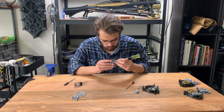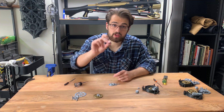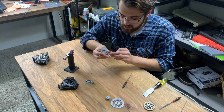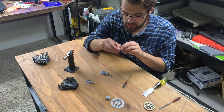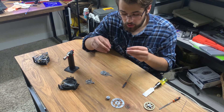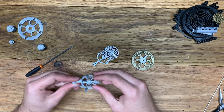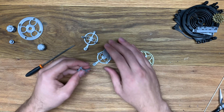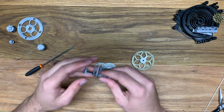That is good for now. You're going to want to temporarily disassemble it and then start fitting the fork. The fork goes in this center hole right there, and you want to make sure it's all nice and clean and that any elephant's foot on it has been scraped away — or preferably just not there to begin with. That goes in and it should be pretty free spinning. It will flop around in both directions right off the bat.